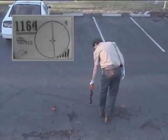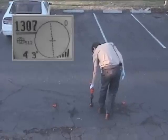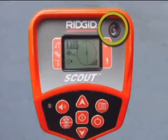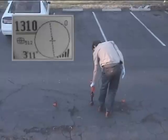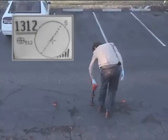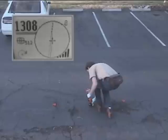To accurately measure depth, the lower antenna housing must be touching the ground, the equator must be centered on the crosshairs, and the receiver must be level. You can use the bubble level on the receiver's face as a guide. When the receiver is properly aligned with the signal, you'll see the depth reading at the bottom left of the display. If you aren't getting a depth reading, rotate the receiver in the direction shown by the arrow. When the arrow disappears, the receiver will display the depth automatically. To double check his depth, he'll rotate the receiver 180 degrees. It should be close to his first measurement, which it is.